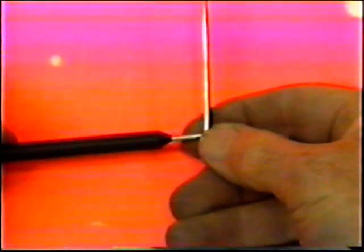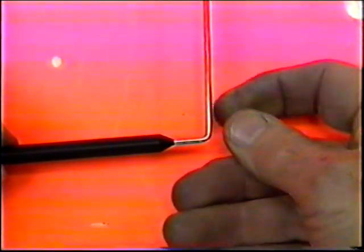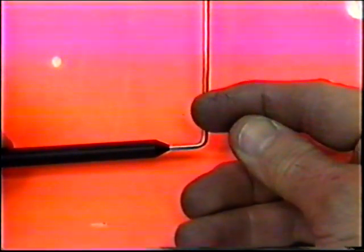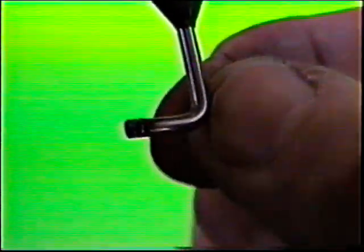Again, you're trying to bend the wire. Vice grip pliers are good, but if anything, bend it just a little bit, not enough, and then bend it little by little back to 90. Don't bend it past 90 and bend it back. Always remember what the rule is. Don't kink and fracture the wire. The radius here should be a nice smooth radius. Don't try to pinch it and never bend it back.